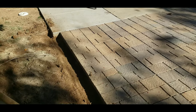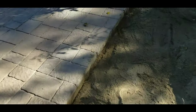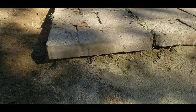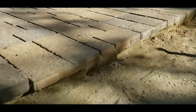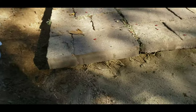We took out the pre-treated wood and went ahead and moved everything back so we can get ready to take the two rows on the left and one row on the right. We'll take all those pavers out, add a little bit of sand, make sure it's level again, put the pavers back, and compact again. We put sand on top. Today I broke a paver — every time I do it the first time I think I broke one, this time I broke another one. Luckily last time we had extra.